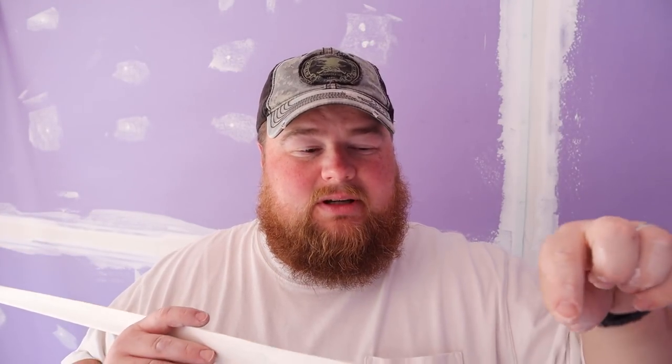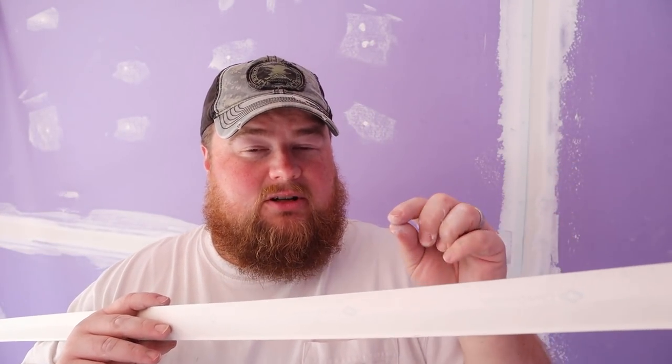It was more expensive than the traditional corner bead that's metal or vinyl that you then nail or screw into place. And I chose this because I thought the corners are already fragile, and if I did a corner bead that I had to then nail or screw in even more, I was really afraid I was going to bust up the drywall in corners. Whereas this seems like a pretty cool medium between the traditional paper method of jointing the boards together, plus has the metal inside as well.